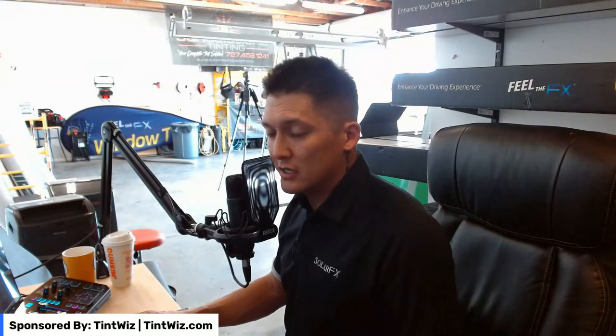Jake Griffith asks: are you still offering classes? Yes, we do have an October class in Montgomery Alabama, and we are setting up a November class because the weather is going to be a lot cooler in the shop. What percentage is good for flat glass on a house? That's a relative term — 15 to 20%. If you go 5%, it's going to be a cave. Also depends on the glass — you can't go too dark on certain films. With dual-pane glass, the absorption rate could be too high and you can break the glass. Check the film compatibility chart from your manufacturer and double-check with your client.